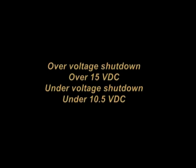This unit features an overvoltage shutdown at 15 volts and an undervoltage shutdown at 10.5 volts. The 15-volt overvoltage shutdown is to ensure that the inverter is never inputted with too high a voltage and damaged. The low voltage shutdown at 10.5 volts is to ensure that the battery voltage always remains with enough voltage to start the vehicle.